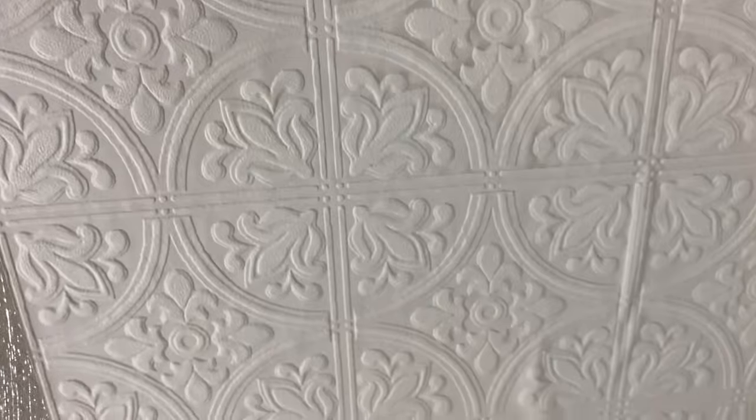After you get the piece hung, or in place, I should say, you don't want to be taking this smoother and dragging it down. No, not at all. Here's what I suggest you do. Do you see where the water in the glue is starting to penetrate and saturate your wall covering? This is really all you have to do. Push it into place with your damp sponge, okay?